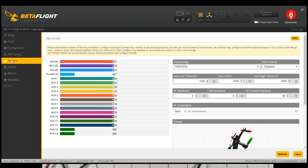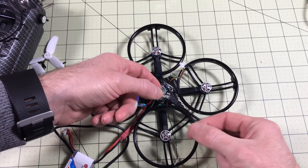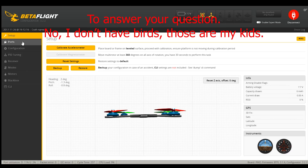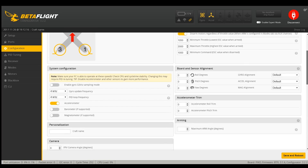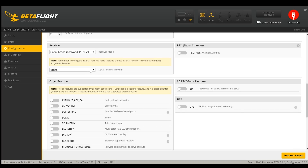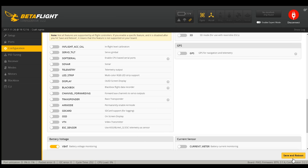Now I'll set up the rest of the channels — we know the soldering works properly. I replaced the antenna on this side since one was missing; it's a little bit longer but I think it'll be okay. Taking a quick look in Betaflight: we're on UART3, which came from the factory that way. This is Multishot — I haven't tested D-shot yet. 4K loop rate, that's fine. I'm going to change arming to 180 because I prefer it that way. I changed this to SBUS; it was on Spectrum. I'm going to lower the VBAT so it doesn't alert me quite so early.